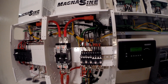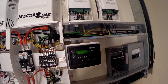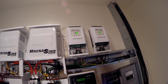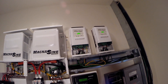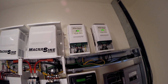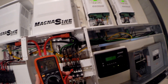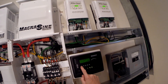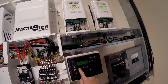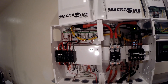So far so good. Battery voltage is 50.9 volts, zero amps. The PV array voltage is 34.9 — okay, no amps there. Battery voltage 50.9, amps zero. There are no volts on the PV because that breaker's not turned on. Port one is the master inverter, port two is the slave, port three is the battery monitor kit — it's thinking. It's powered but I haven't turned it on yet, so when I turn this on it's going to start looking for a load.